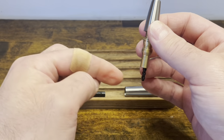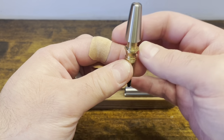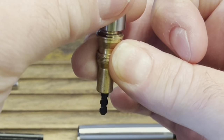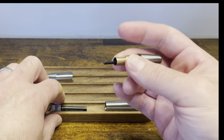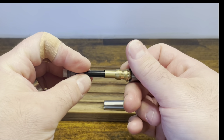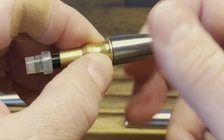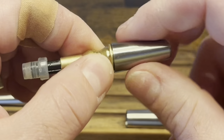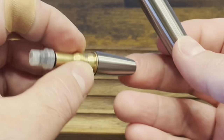It's kind of challenging to get the piston rod lined up properly with this sub-assembly, but if you give the piston a turn, eventually you're going to see the thread start to catch. Now whenever I turn the knob, the thread should turn with it. The piston rod is ready to be slid back on. Now twist it all the way down, and what we're looking for is for this piston knob — the silver piece — to line up with this flange right here. Sometimes this takes a couple of times of twisting the knob and putting the piston rod back in to get it to fully seat, but that looks just about perfect.